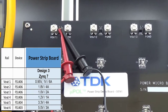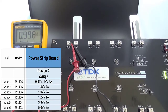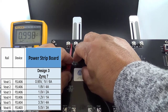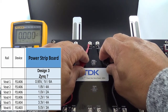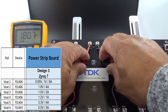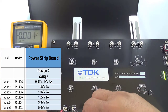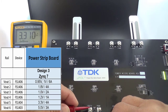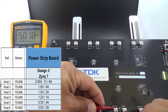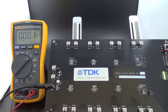As we go through the rest of the modules on the board, you can take your meter and show some quick designs. There are leads for ground and the output of each one. Output 2 is going to be basically 1.8 volts — this is the VCC aux rail of the FPGA. Output 3 can be used for bus voltages or the SERDES voltages for the Zynq 7. Output 4 is used for the memory rail DDR, the PSDDR rail, or also can be used for the SERDES rails of the Zynq 7. Outputs 5 and 6 are the system supplies: 3.3V and the 5V supply.